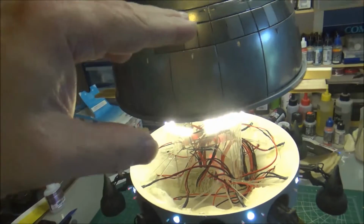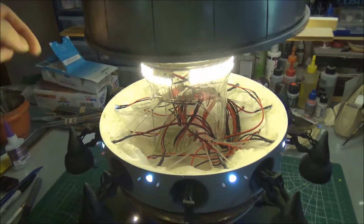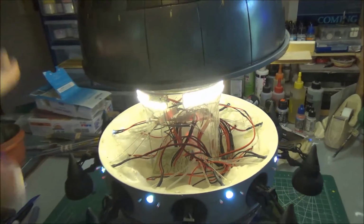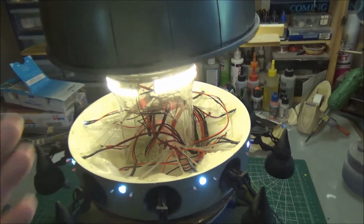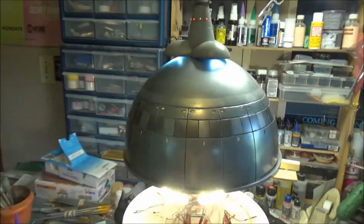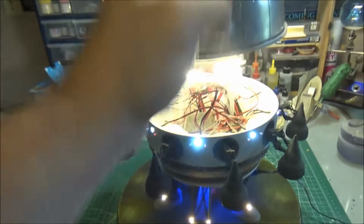I've got this raised up and blocked so that when I've got the glue down, all I need to do is pull out these strips and set the whole thing down. I don't want to have to try to refigure. I've got my center line marked out with my steps, of the ramp. Everything goes up straight through the center here.